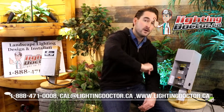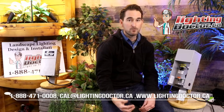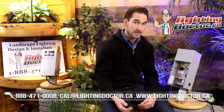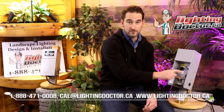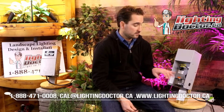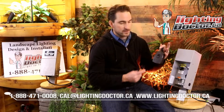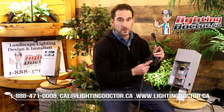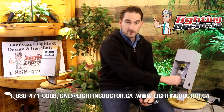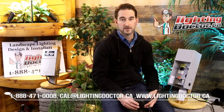That's an easy way to avoid adding multiple transformers and save some money — you can run two separate lines, or even three, and easily fit those wires into this terminal. To make this Wi-Fi enabled, you can do that with the YON timer: plug this into your receptacle, plug this into your YON timer, flick the on switch and leave it on, then control everything via your app or Amazon Alexa.